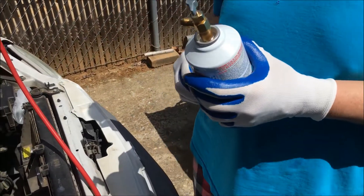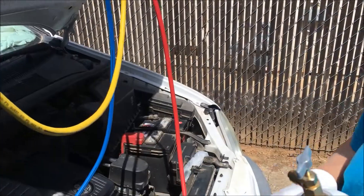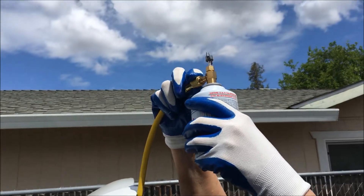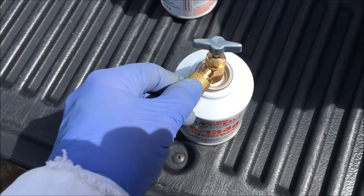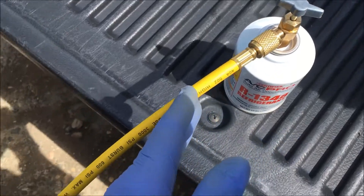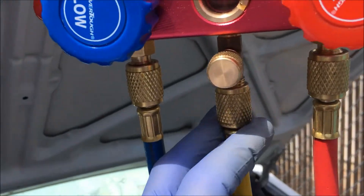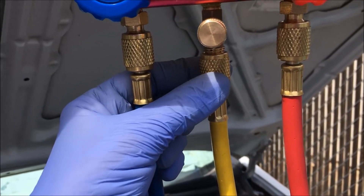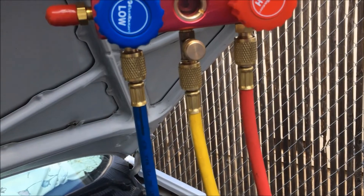You also want to have a pair of gloves — preferably leather, but we're using plastic. We're now going to attach the can to the line that has the oil in it. Make sure all these fittings are tight. When that refrigerant flows through, it's going to push the refrigerant and the oil up to the head of this supply line. Then we're going to open that a little bit to purge any air that's in that line, because you don't want to send air into your already vacuumed-out system with no moisture in it.